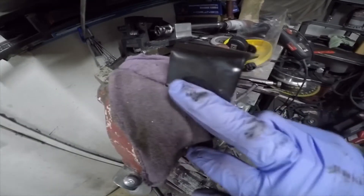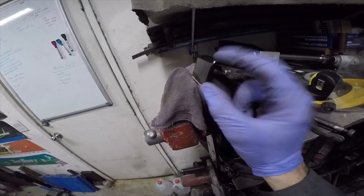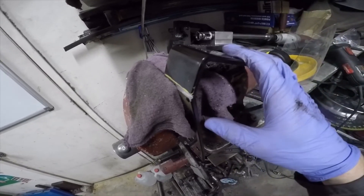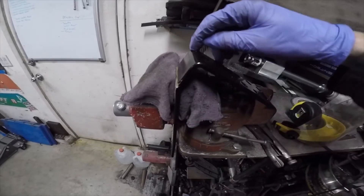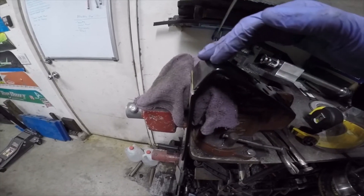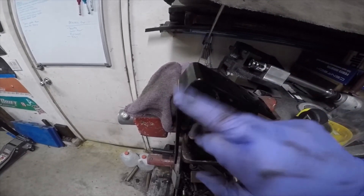This mark is about an inch and a half from the actual 90-degree we had, so I cut a slot in it so you can bend it — this is a quarter-inch thick plate, extremely strong, very hard to bend. So we cut a slot in it, then hit it with a hammer and bent it down to about 45 degrees. Then we're going to cut a relief slot right here and bend this up, so we'll have a total radius of 90 degrees achieved through two 45s.